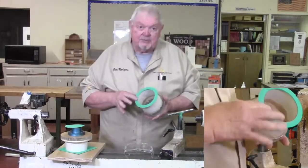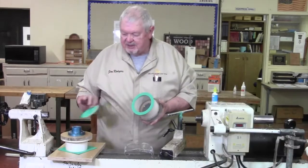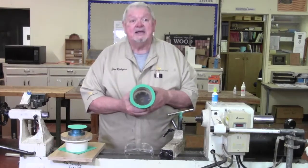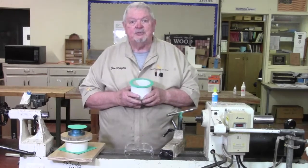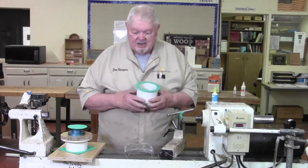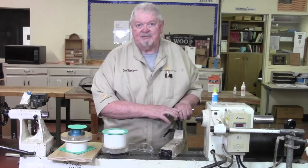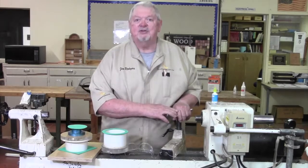Sometimes over time these seals will eventually break down. That's fine — I always have plenty of foam. I re-true the edge, put a little bit of glue on it again, and put another piece on. So there's your vacuum chuck — any size, any shape you want, you can make. I hope this series has helped you consider adding vacuum chucking to your systems, because finishing the bottoms of projects on a vacuum chuck is extremely easy and saves a lot of difficulties with making special jam chucks.